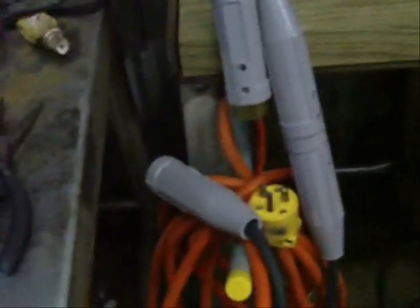You're not really supposed to be able to pull them apart like I just did. I've got to get a lug to fit my new big heavy ground clamp. The reason I've got a big heavy one is because the one that comes with these welders is dinky. Look at the difference — which one do you think is going to ground better? I'm guessing the copper strap and the big copper lugs.